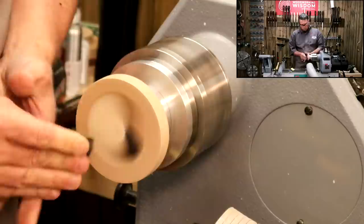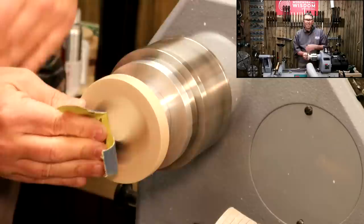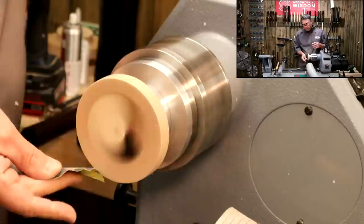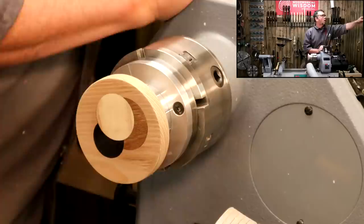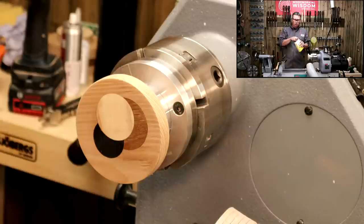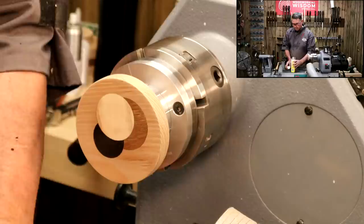240 and then 400 — take your time, you don't need to be rushing this. If you want to go a little bit further and use epoxy resin on these, a countertop resin would work really well — countertop resins are designed for this sort of thing. I've used countertop resin on some coasters and it has worked well. I've done some tables with casting resin and it hasn't worked as well, but countertop resin has been really good.